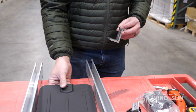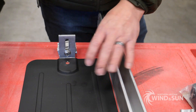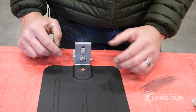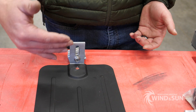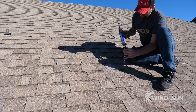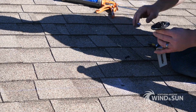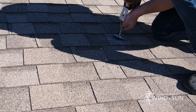You're going to mount your feet to your flashing — here are your flashings here. The feet themselves will slide up underneath the flashing. The flashing will typically slide up underneath your shingle if you have an asphalt shingle roof, and then you'll lag the foot into your rafter. There are a multitude of different flashing configurations you can use. I used the QuickBolt flashings because they were a lot easier, and also it was very cold during our installation, so the tar layer on the edge of the asphalt made it very hard to lift up the shingles.